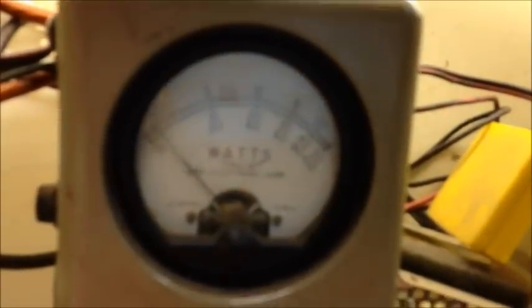Oh yeah. So a good 51, maybe 52 out of it. And like I said, about 14 bird. Now, I set the radio up so it don't dead key over 5. That would be crazy nonsense for a radio to dead key over 5. I'm pretty sure that's where I got it set at. We'll double check it though. Should be 5 watt dead key. Okay, it's right over 5. But this is what you'll get out of it at 5.